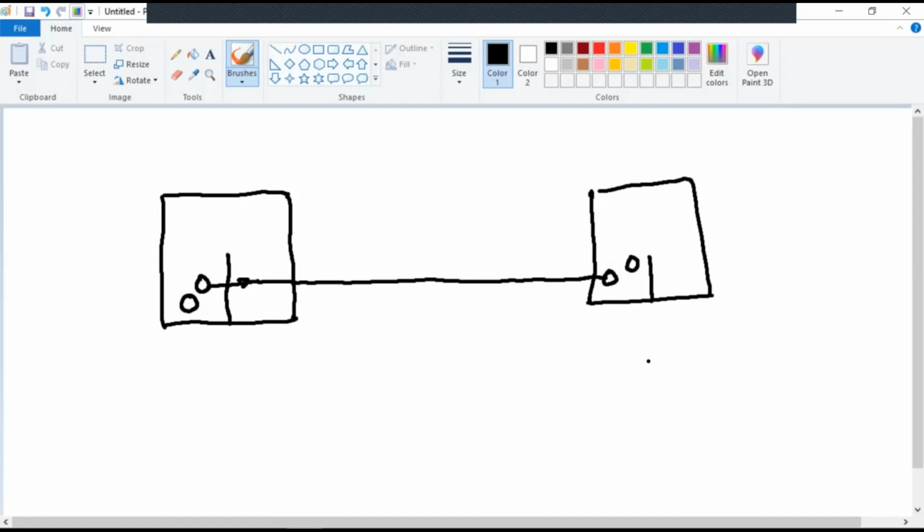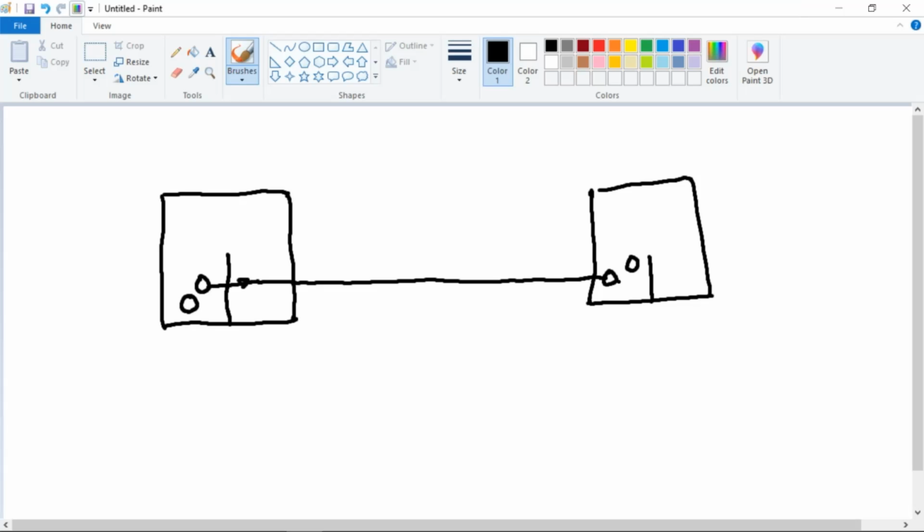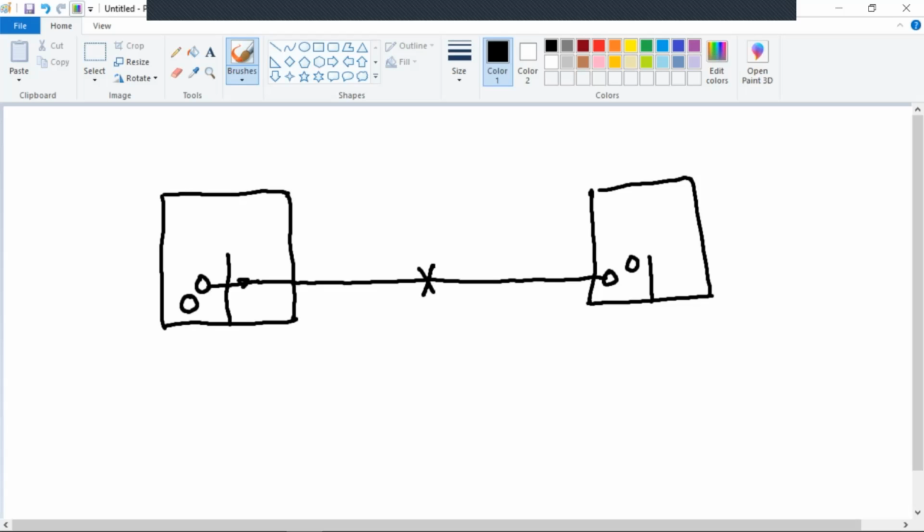Pull all three wires. You got to pull all three out. And I have to admit, it wasn't too long ago, 10 or 15 years ago, we used what they called single pipe. We'd use a 6-inch conduit and pull all three phases in it. Yeah, we thought it was the cat's meow. How many different pulls do you have to make? One. Even for a long distance, all you have to do is make one pull of all three phases at one time. But you have a failure of one phase inside this conduit.